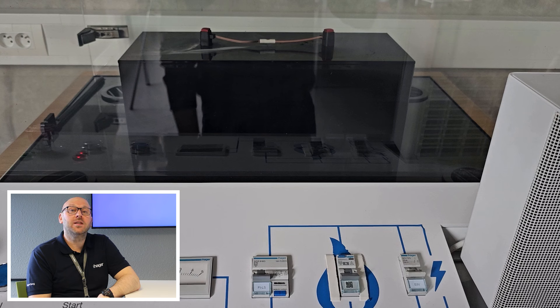The testing you can see on screen uses a cable specimen test — we use this test for the new single modular AFDD, so the algorithms are built around this kind of testing. Whereas the double modular sized AFDD, which was our first AFDD, was built using an arc generator algorithm. Both are fully compliant to the standard, as Nicholas explained earlier, but there will be some differences in how they react.